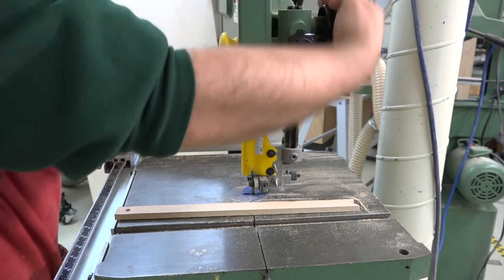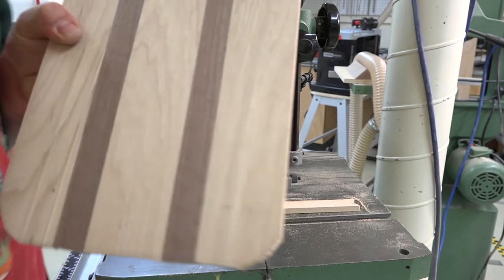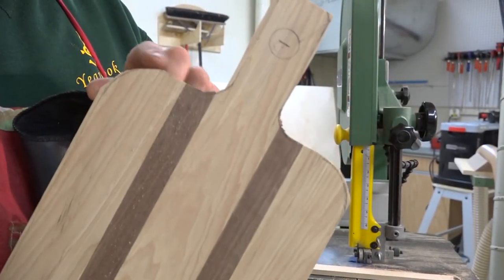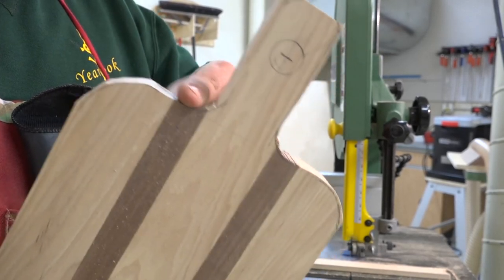When you're done, we want to make sure we do maintenance. Put down the blade. Now I'm just going to take this piece of wood over to the disc and belt sander. I'll use a disc sander to round outside curves, and any inside curves I'll use on a drum sander.